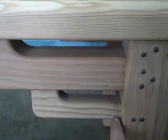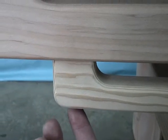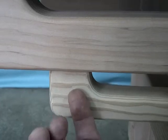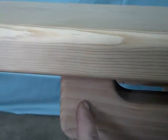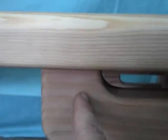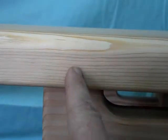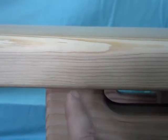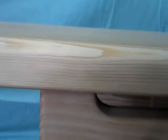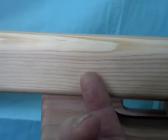This one is mortised in using a floating tenon. From underneath, I've used a Forstner bit to create a very clean hole where I've drilled a bolt up to secure it. A tenon is basically a wooden member glued into a socket in one board that then meets another socket — the mortise — in the adjoining piece. The mortise and tenons here join this together, but they're not glued. I've made this bench so it can be knocked down if I have to ship it. There's another bolt underneath that goes up through the mortise into the hole.